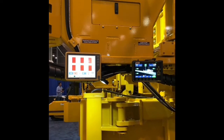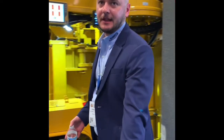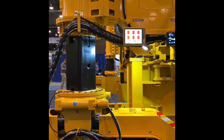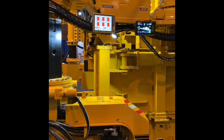The machine uses immersion vibrators positioned at around 40 centimeter spacing, with individual variable controls at the top of the machine. You can adjust each one. There's also a 3D system with many options. Normally you have string lines with sensor arms touching the line for guidance, but with this technology the machine has a 3D system using a total station on the job site, checking the position of the machine — its grading and location — almost 20 times per second, so we're paving in best millimetric grades.